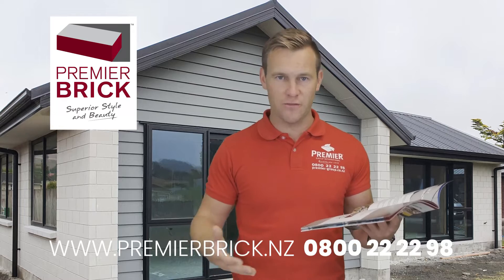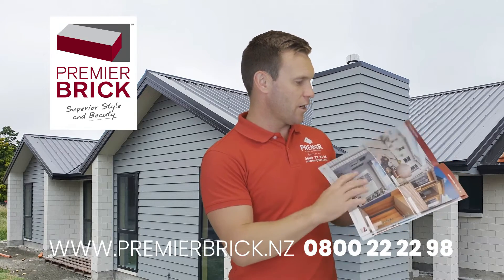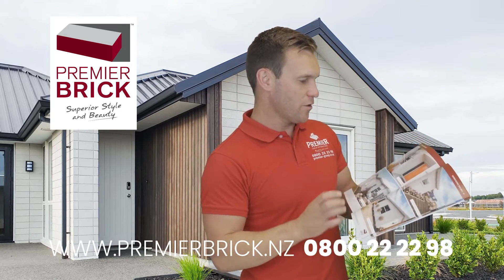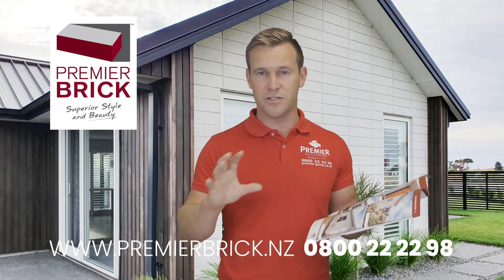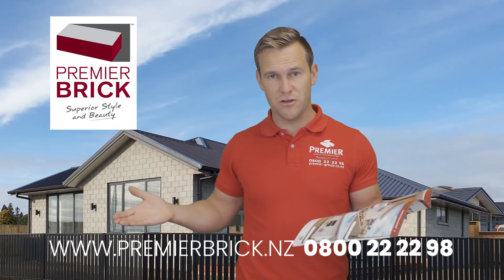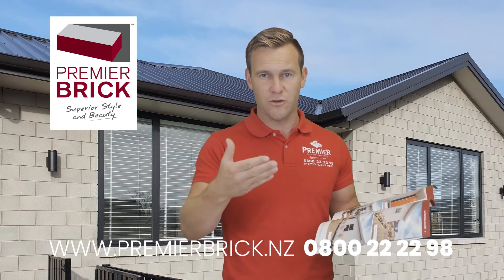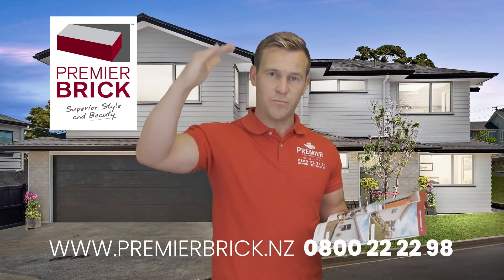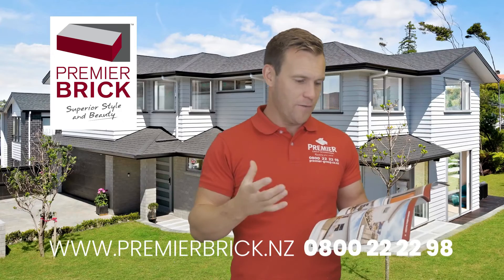So it can really help you achieve a great overall look. If you look through our pictures here in the brochure, you'll see there are lots of different options, but the mortar colour actually has a big impact on the overall look of your veneer or brick job or your home. The more consistent you can get that mortar, the better. It's impossible to get a perfect colour match because your bricklayer is dealing with weather conditions on site — even an extra litre of water in the mix is going to affect the finished colour of your mortar. The weather and temperature affect how fast it dries out, so you're always going to get some colour variation, but the goal is to minimise that and we can really help you with that.